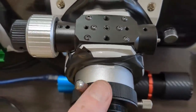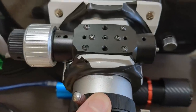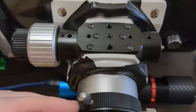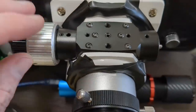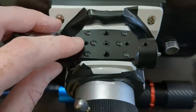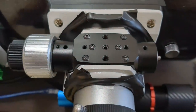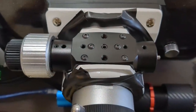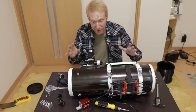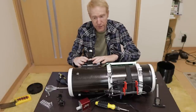You also want to make sure that by pushing or pulling on this you're not having the draw tube immediately pushed in or out without having to use the knob. It's a very delicate balance and I finally achieved it. It's very difficult to explain on video how to achieve that balance — you really have to try it out on your own.